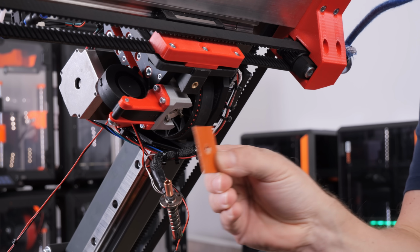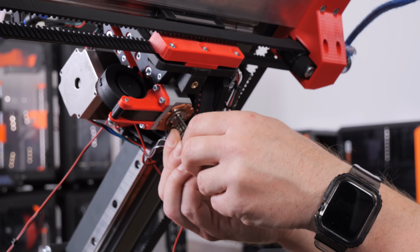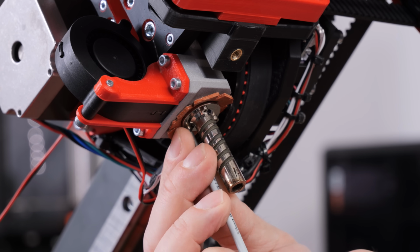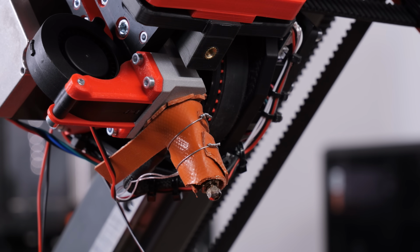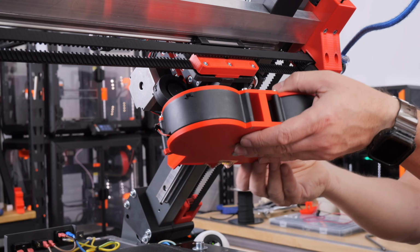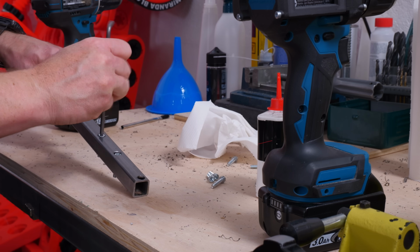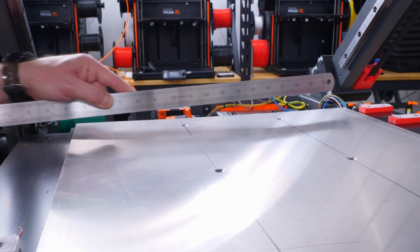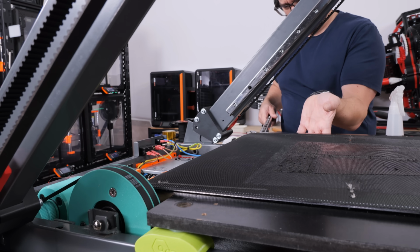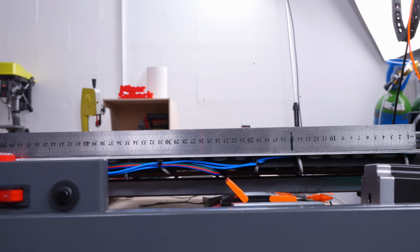And the last thing that we need so the extruder can go as fast as possible is add extra insulation. When printing at max speed, the hot end can barely maintain the temperature, so we need to minimize heat loss outwards, so we can transfer as much heat to the filament as possible. I also had to build this contraption with a row of adjustment screws to flatten the part of the belt where the nozzle lays down the filament, so the nozzle doesn't destroy the belt.